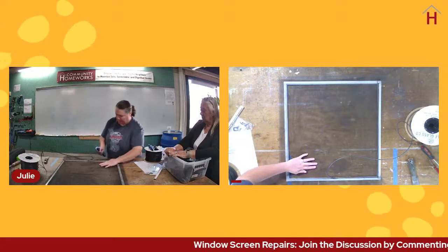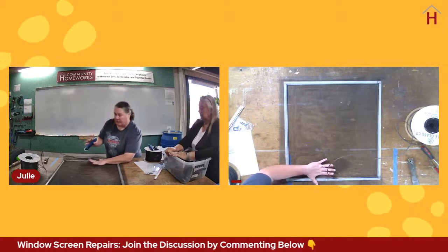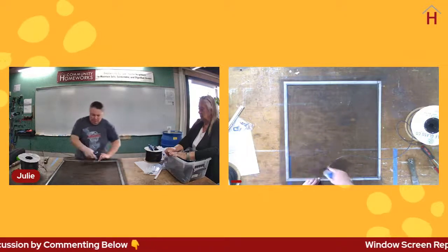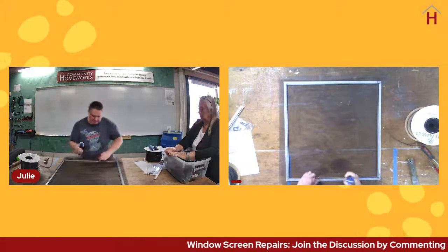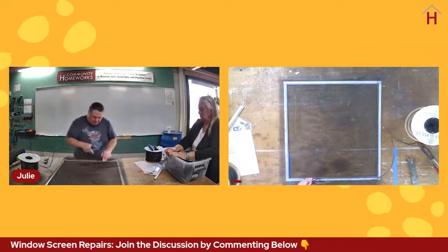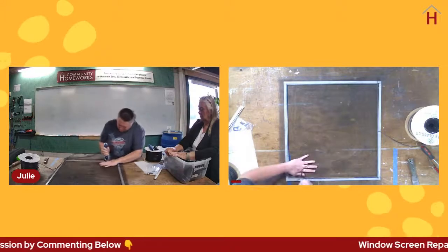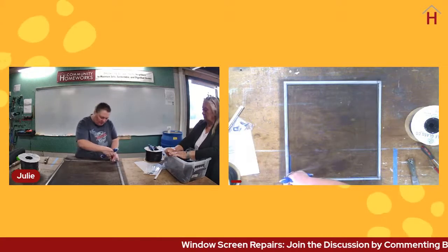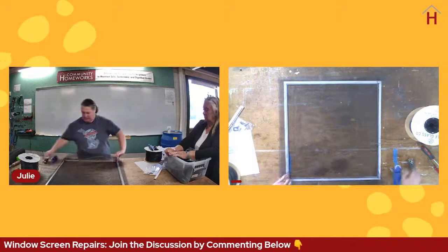Sometimes you'll find that whatever your screen is doing, it doesn't want to stay in there at all, and that makes it much more challenging. In those cases, I'll just do a little bit at a time, and then I'll hold it with my finger so that it doesn't pop out, or it's less likely to pop out. Just do a little bit. This goes a lot easier if you do seat the screen in the spline channel first. So if you have to do it a little bit at a time, that's totally fine.